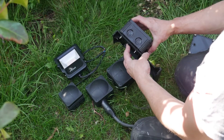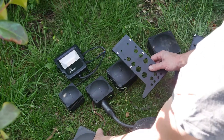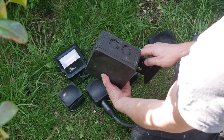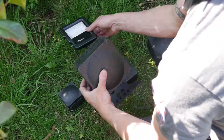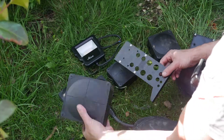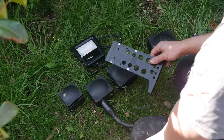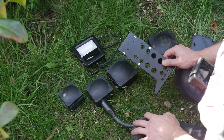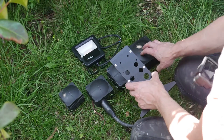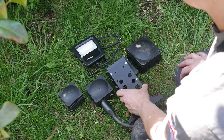You could actually fit a 1010 box to this, but it's going to sit quite high on the mount, and by the time you put your floodlight on it's going to be quite tight. Also with the 1010 box you're not going to have a lot of room for your SWA glands, so just be mindful of that. I'd recommend the limit at 607.